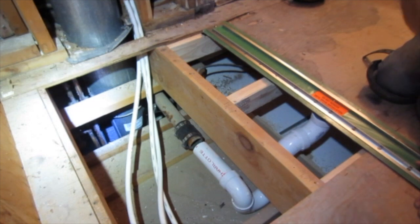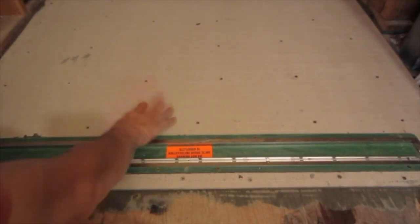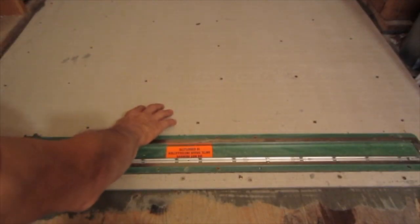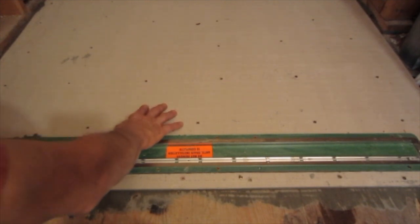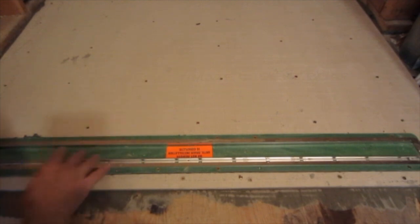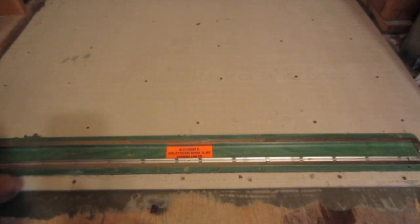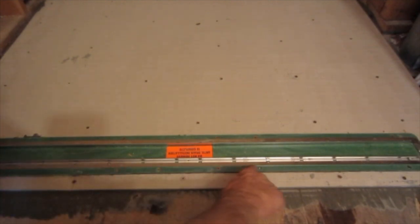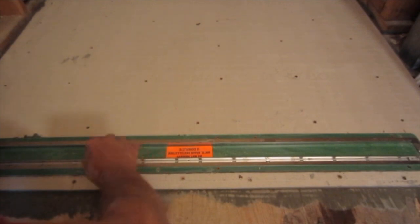Next is going to be the Go Board that goes up the walls, then the slope, then all the waterproofing. I have the quarter inch backer board in place — I set it with thinset using a quarter by quarter inch trowel. I have my drain screwed into place. If you run your finger along this green taped edge you'll find the indentations where the screws go and they fit flush.